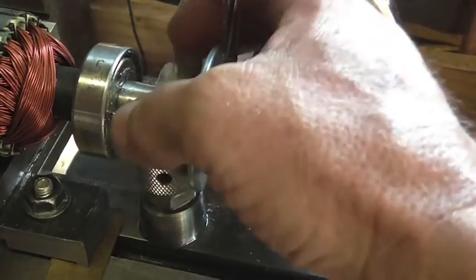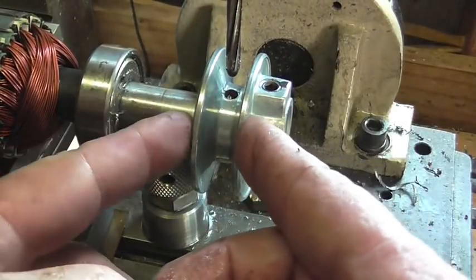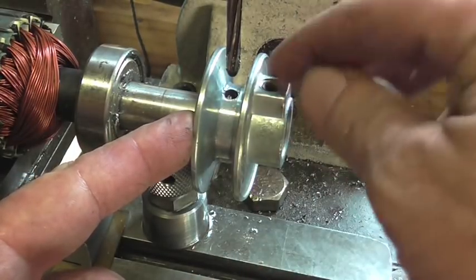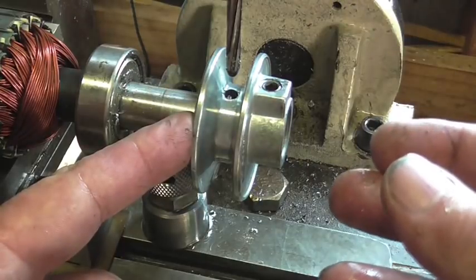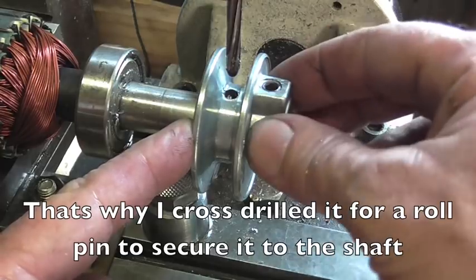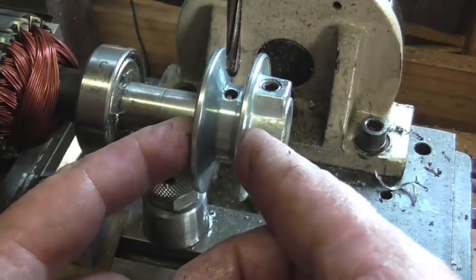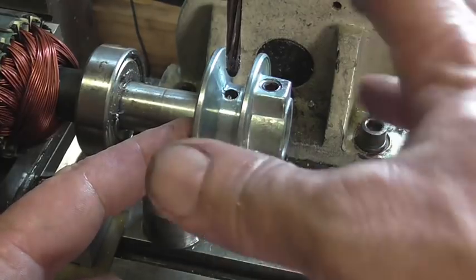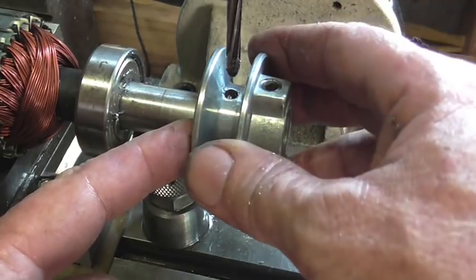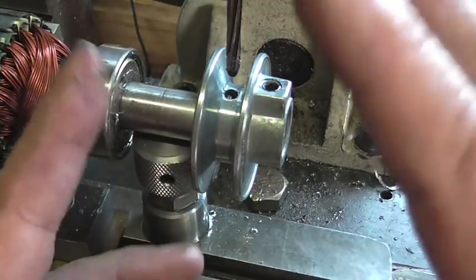This is not the right pulley for this particular shaft. The threads on the shaft only come out to here, so this set screw that's on this pulley basically does nothing. So I told the customer I'm going to machine off this boss right here — basically machine all this off right up to here — so the entire pulley is sitting on threads and we don't have this boss throwing the pulley off balance. I'm going to take that over to the lathe, machine that off, and this job is done.